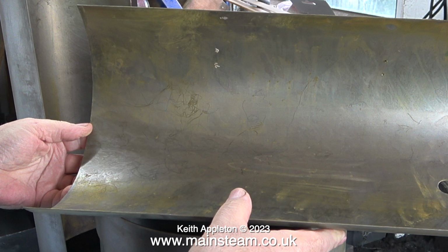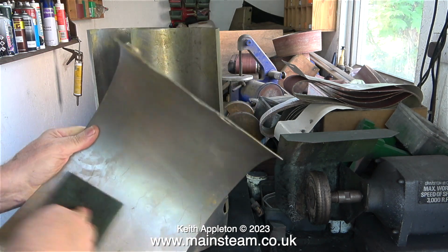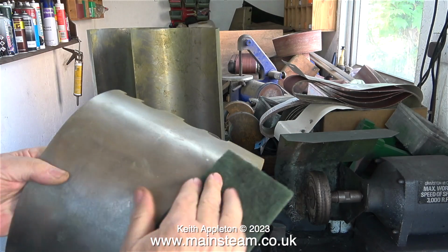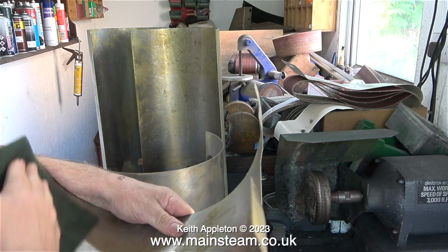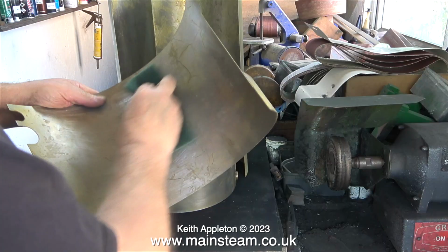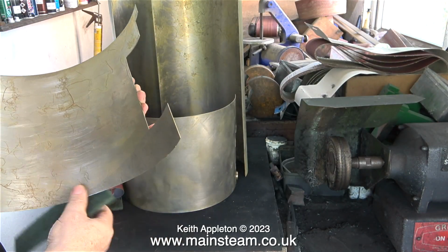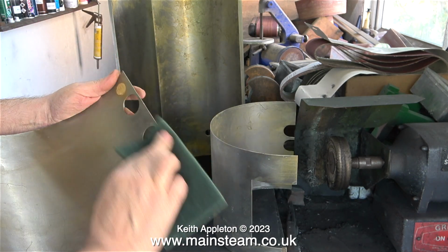You can see in this clip that some of the original rust that was underneath the paint can still be seen. So I need to rub down these panels, first of all with Scotch-Brite to remove the surface rust, and then for the heavier rust I use some emery cloth. Some of the edges of this cladding are quite sharp, so I'm being very careful not to sever my hand. To get through the job in a reasonable time, the video is running much faster than normal. The emery cloth makes most noise, but removes the most rust, followed by Scotch-Brite, which is really good stuff.